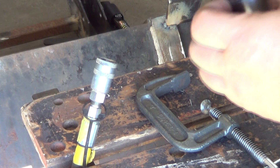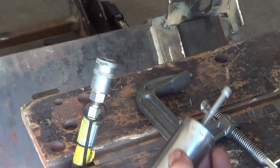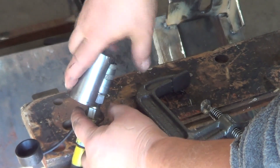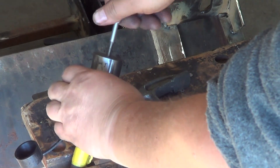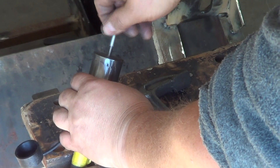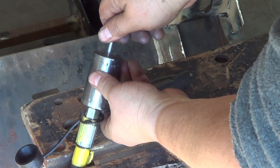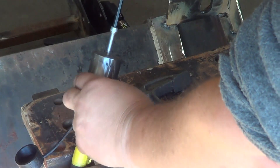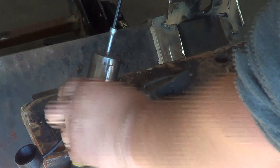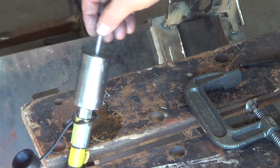Now when you try your new tool — and here's mine, it's as good as I want it to look — always wear eye protection. Put it in over the top. Always face the open side away from you. Now we're tight into the middle, so put my glasses on, let's hold this, and there we go. It released the entire amount of pressure that was in there. Makes a bit of a mess, so make sure you use a towel.